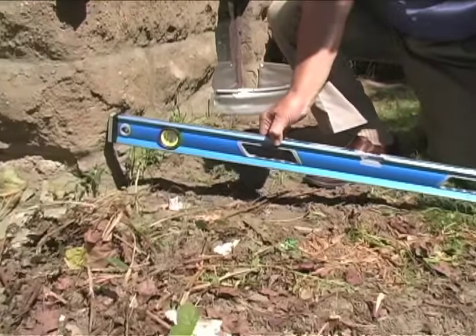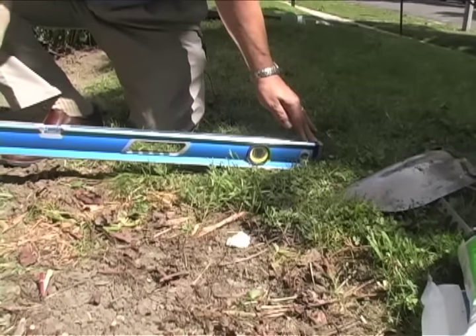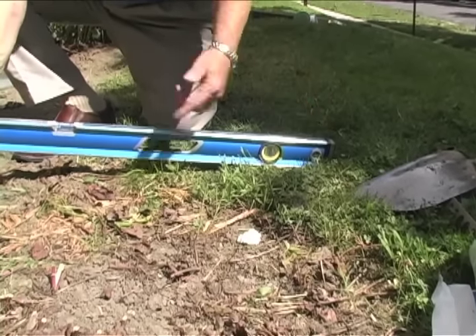wall, it should be about four inches higher than it is out at the end of this four-foot level. That's what you're looking for. This means adding soil around the house, building it right up to window wells if necessary. The point is, make sure that it's pitched away from the house wherever possible, so water goes away and not toward your basement.